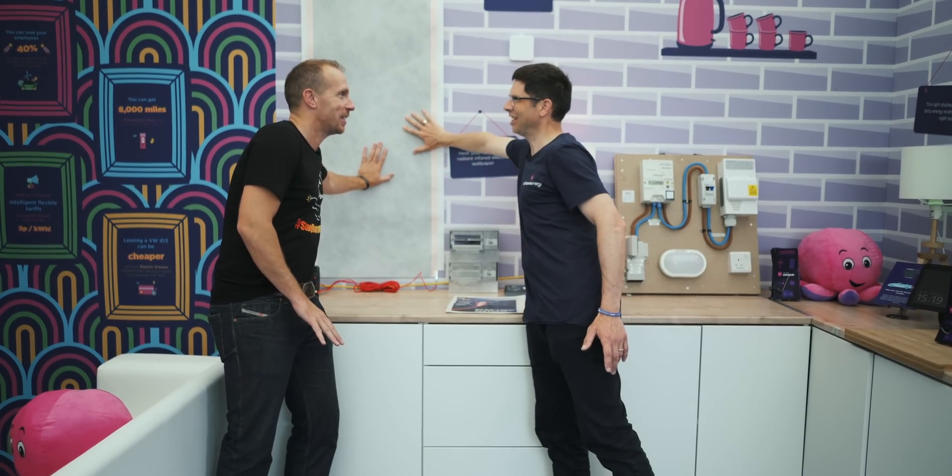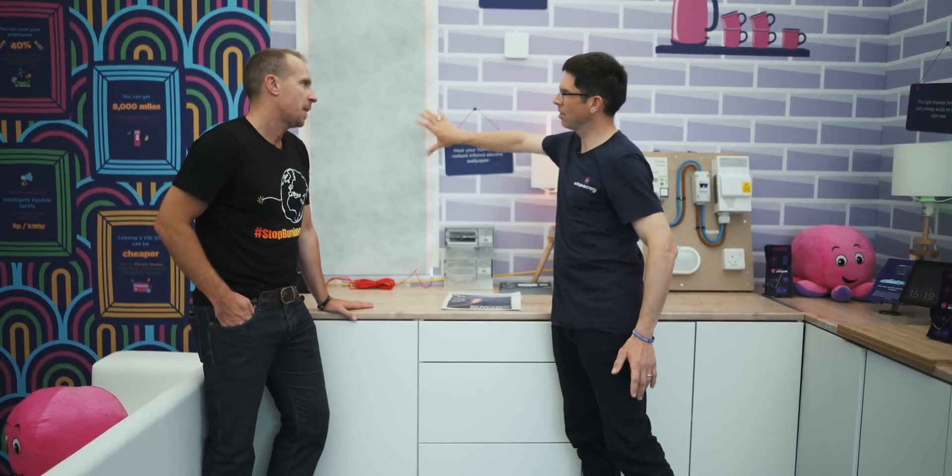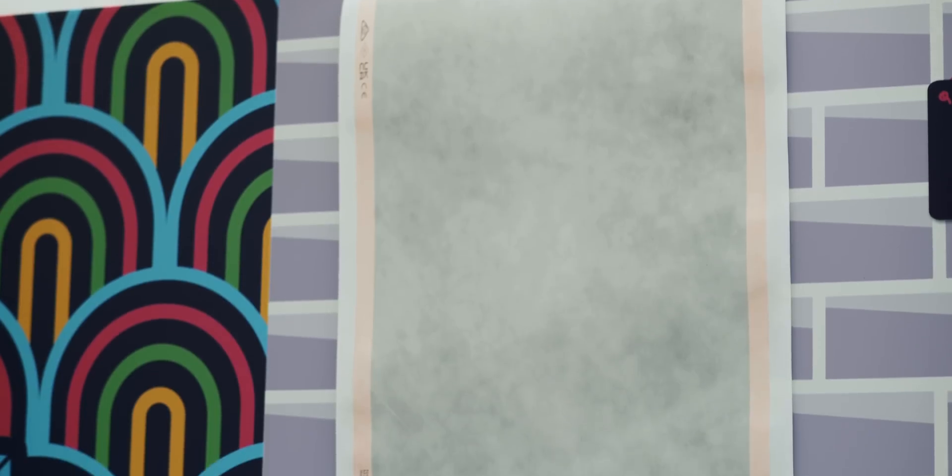It's hot in here anyway because the sun's out. It's warm but you can feel that. What this is actually doing is emitting infrared. These two copper strips either side have got 24-volt AC running up them, and that's a graphene layer we can see in between. That graphene is being powered and is emitting infrared heat. How easy is it to put up electric wallpaper? It's about as easy as that.